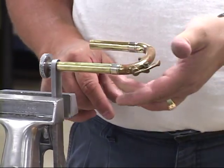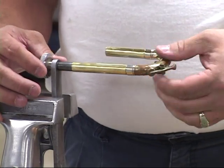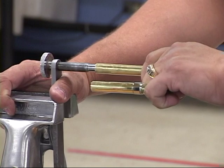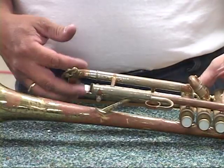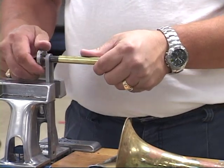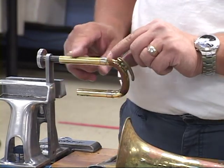The small expander fits nicely inside and will travel almost all the way through. We need to mark and figure out our distance. We pull back on the knob and dial it forward — we want to grab it just so it's a little tight, finger tight, so I can still move this with one finger. Then I slowly pull and work the slide out, a little bit at a time. This will loosen it up a bit and also true up the slide if the slide is out of round. You must be careful — if you just hold it from the crook end, the chances of bending the crook are very great, especially if you've gone slightly too tight. If you feel it's too tight, loosen and push in.